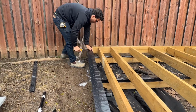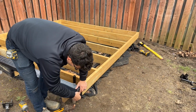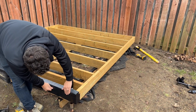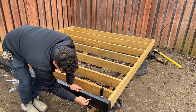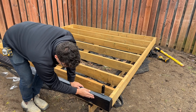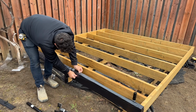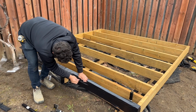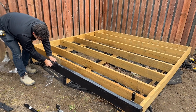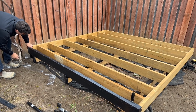In order to build this envelope, we're simply going to do this little cut here, turn this in, turn this down, and you see how now if water does get in, it's going to flow past. That way the seam, I put this one on first, this one on second, that way the water flows down, kind of like a shingle, kind of like building that envelope. Keeping the wrinkles out is best. I'm not the best at keeping wrinkles off of things. I suggest you use your delicate hands if you have them, or if you have a laborer with delicate hands, use him.